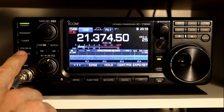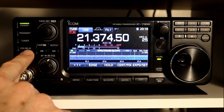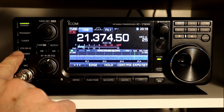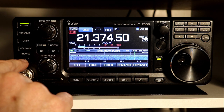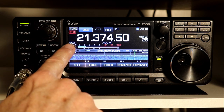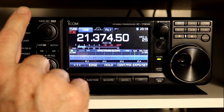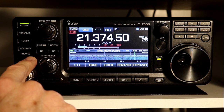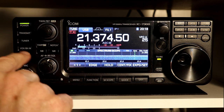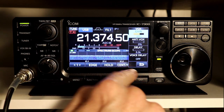The VOX function is activated by the VOX/break-in button. Break-in is for CW — we'll talk about that in a separate episode. You press the VOX button, it turns VOX on in the display, and then you press it again to turn it off. VOX is voice-operated transmit, and there are some settings for it. Like most 7300 settings, if you press and hold the button, you get the settings menu.